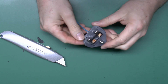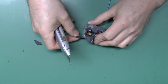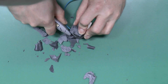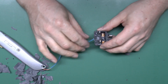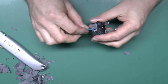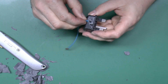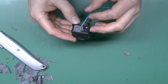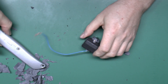Now of course these things are not supposed to be opened up, so it's not desperately easy to get into them, but we'll persevere and hopefully remove this flexible covering. Right, I've got rid of most of the grey covering, and as you can see that's the earth connection there, which is of course not connected in this case. And this neutral, even though I've actually managed to cut through it with a knife, it's still pretty firmly attached on there. Now this part appears to be welded shut of course, which is not very helpful, so it may be necessary to drill it out or cut off some of these lugs around the edge.